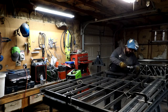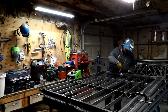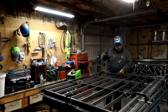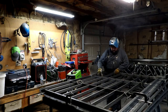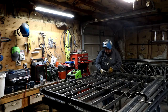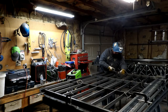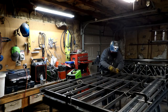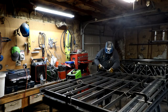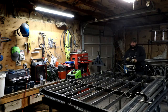And so now we're continuing spacing on the third panel and getting all of that in. And once again, I'm putting everything in, trying to straighten everything out with a crescent wrench. That's why I only tack on top initially. That way, if I need to adjust it to make sure it's square, I can. One thing I always do afterwards is I'll stand at the end of my piece, regardless of what my tape measure tells me. I will stand at the end of my piece and make sure everything looks like it's running in a straight line, and that's what I'm doing right now.